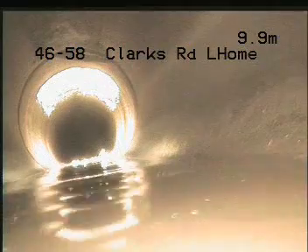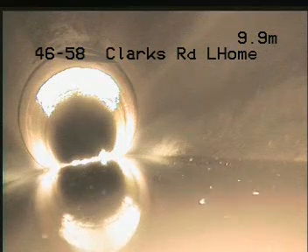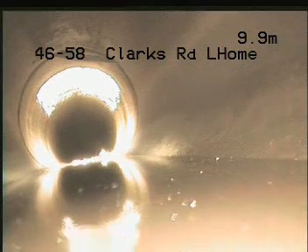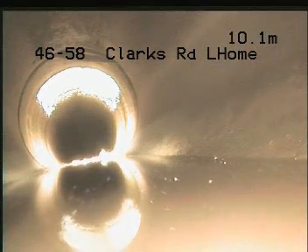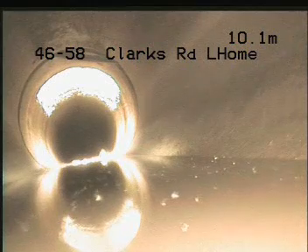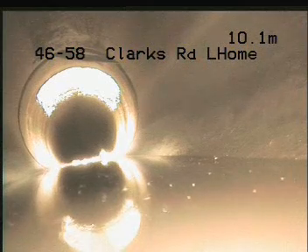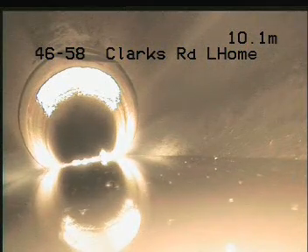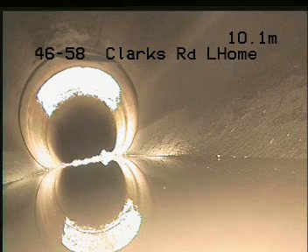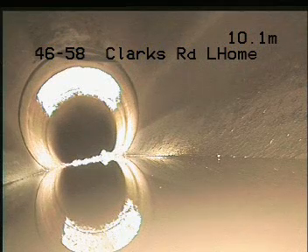Now hold it there — as you can see, looking down that line there's actually a broken seal on the stormwater pipe. You can see that quite clearly at the top left of the screen. That line is holding water, has sunk down, and it's broken the seal. I'm suspecting that this is sucking all the fill through and into the stormwater line. You can see the ring that's come down — that would vortex the line and pull the subterranean ground away.